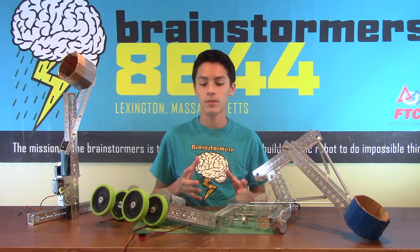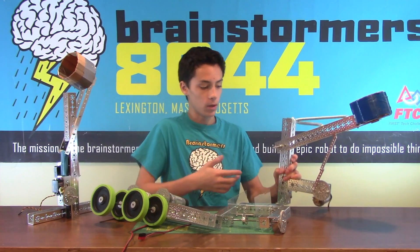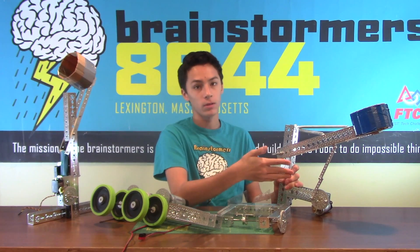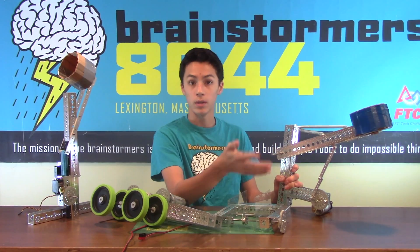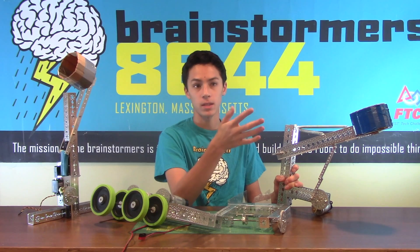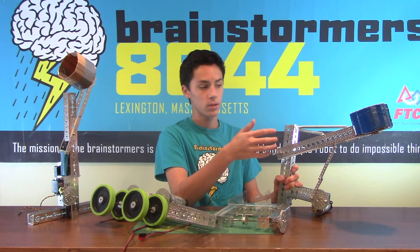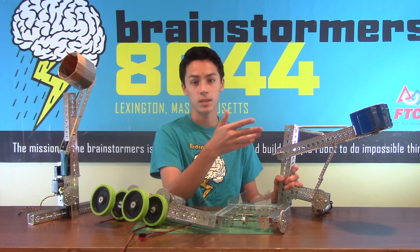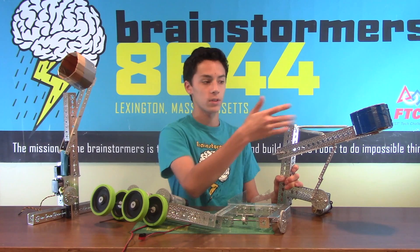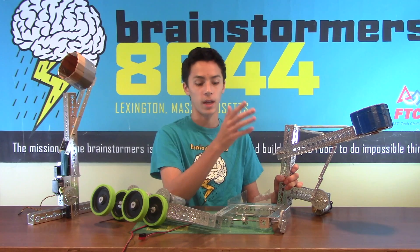All these systems have a lot of pros and cons. Starting with the rapid fire catapult: because it has a linkage there can be a lot of mechanical failure, but because of this linkage it shoots really quickly, and because it's spring powered there's a lot of accuracy to the system. The only disadvantage is that you don't have any distance control because there's a set spring tension, and unless you can figure out a way to adjust that spring tension, that's the fixed distance and shot you're going to have.